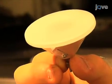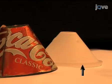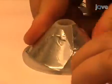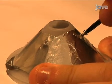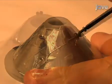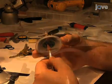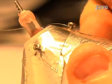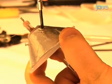The protective cone's purpose is to shield micro drives and the exposed tetrode wire from the environment. It also provides support for handling during an experiment and reduces electrical noise. We use a 3D printed plastic cone. However, it is possible to make the cone from other materials like a bent piece of soda can. Take the plastic cone and fix some aluminum foil tape to the inner or outer surface. First, insert and partially turn three 1-72 size screws 3/16 inches in length into the sides of the cone. With the drive array suspended, insert the cone over the drive. Make sure both ground wires extend from the bottom of the drive array. Wrap the exposed part of the 4 inch ground wire around one of the 1-72 screws several times and fasten the screw tightly. Secure the cone to the drive base by tightening the remaining two cone screws.